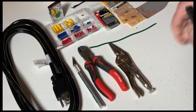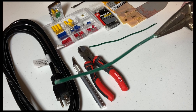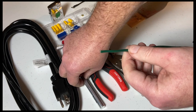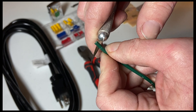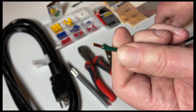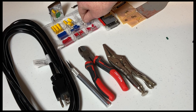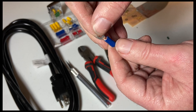In order to use the wires individually, I had to remove them from the outer covering, so that is where I used the needle nose vice grips to pull the wires out of the sleeve. Once I had them removed, I just stripped away a quarter of an inch to a half an inch of the plastic to expose the bare wire. Then I just twist the ends and select a connector I wanted to use — in this case I used mostly ring connectors. You simply slip the wire in and then crimp the end around it. I am using the vice grips for this.